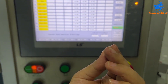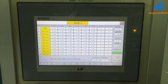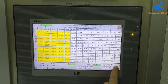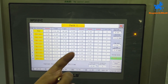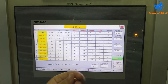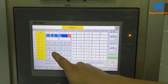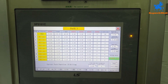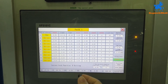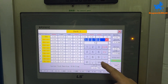This ball has 9 lines. Maybe we need to set more knife cuts. To set more cuts, press the pass table. You can see it is 9 — we want to change it to around 30, so set 30. The degree also needs to change: 360 degrees divided by 30 equals 12, so here we set 12.